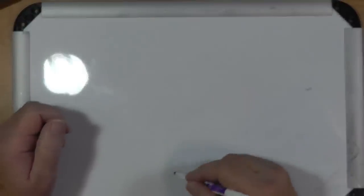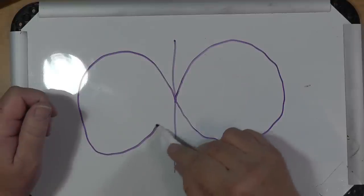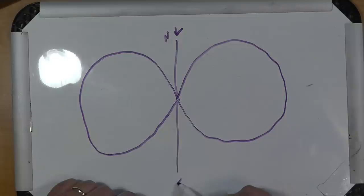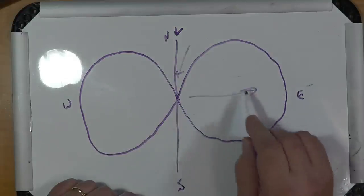Do I have to aim the antenna in a particular direction — north, south, or east and west? Well, let's look at the free space dipole pattern. If this is the dipole right here, let's say this is north and south, and then this is east and west. You get a sharp null here, and you get most of your radiation going this way. This is for a dipole in free space.